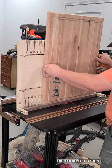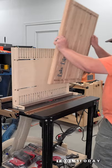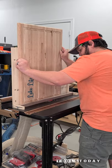You can see here we have several different adjustments. One of the adjustments keeps the board nice and flush up against the jig, and then the other one is a fence to set the length of that finger hold. We'll just turn the bit on and set that down on top of it, and we'll take two passes to get down to the final depth.